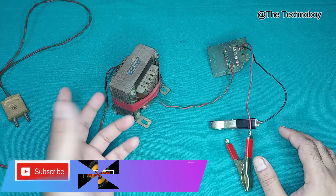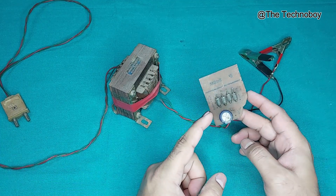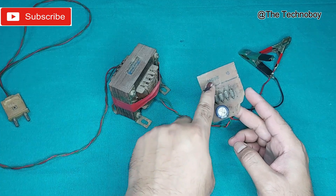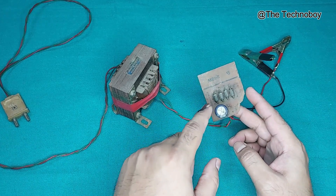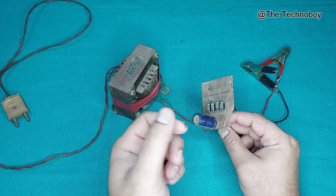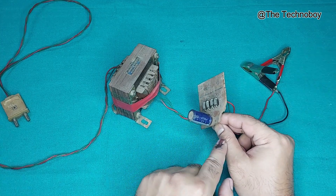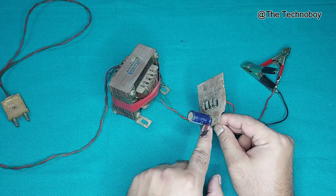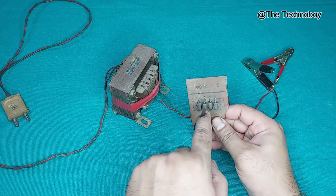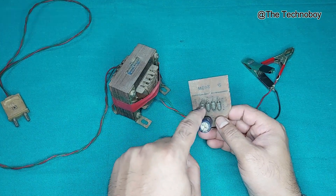This will cost you around 300 to 400. And along with that, you need a rectifier kit just like this. I took this kit out of a very old damaged amplifier — you can see 240 watt mentioned there, that was the amplifier's power. You'll find a rectifier kit 12 volt at the market or even online. But if you want to make it yourself, you need a capacitor just like this, 25 volt, and better to use 4700 MFD of capacitance. And these are old school diodes, but nowadays you can buy a bridge rectifier so you don't need all these four old school diodes.